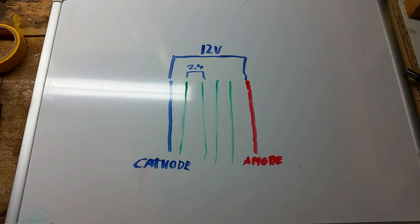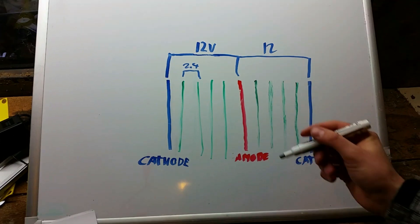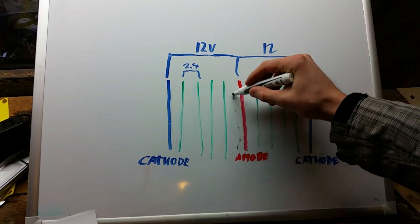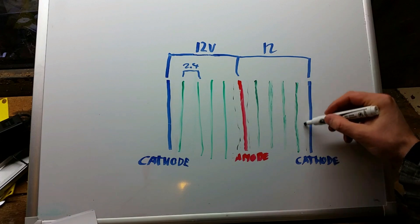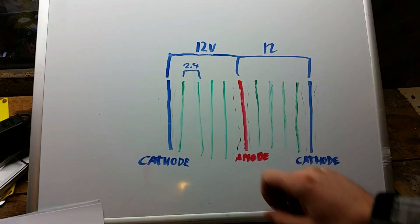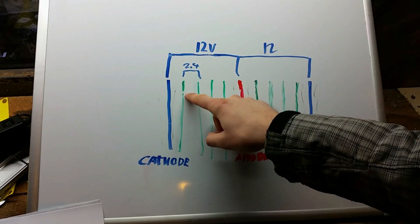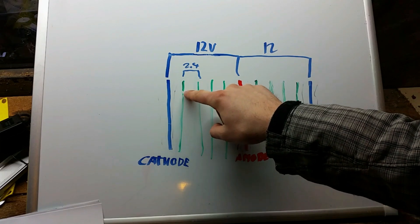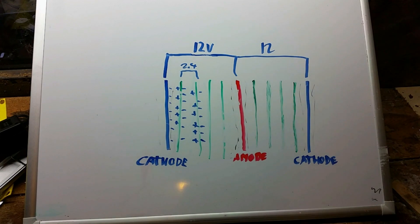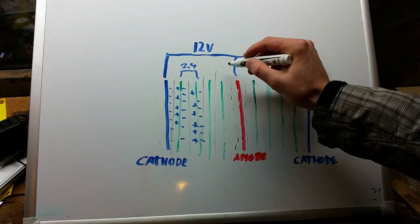This creates the same amount of gas but with almost no heat. My generator is actually two generators side by side — it has 1 anode in the middle and 2 cathodes on the outside, with 4 neutral plates on either side. The anode generates oxygen and the cathode generates hydrogen. Each neutral plate acts as an anode on the side facing the cathode — generating oxygen — and as a cathode on the side facing the anode, generating hydrogen. So then I needed to put my membrane in between each section so the gases could be separated.